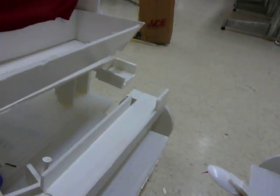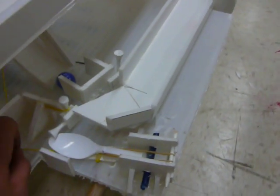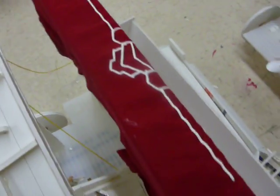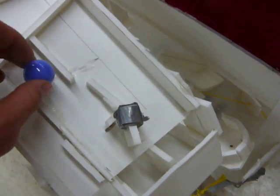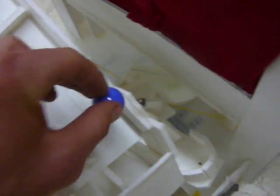Our launching mechanisms are basically plastic spoons that are powered by rubber bands, and there is a required delay between catching and launching. What we have used for that delay are marbles that run down a track here, which hit this splitting device, because we have different routes that each marble must go through. The first marble comes through and triggers this splitting device so the second one comes through at this angle.